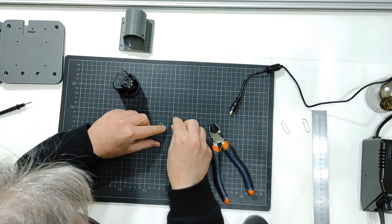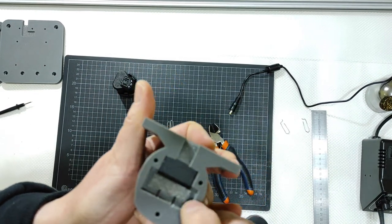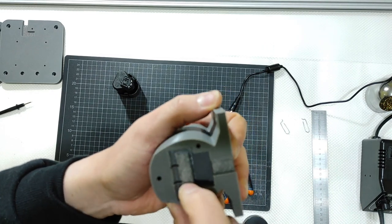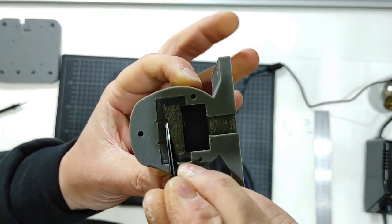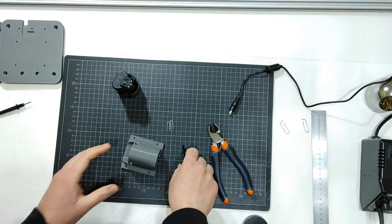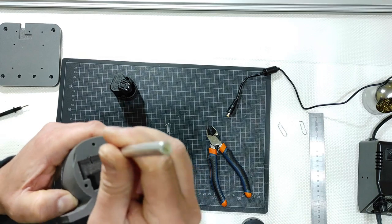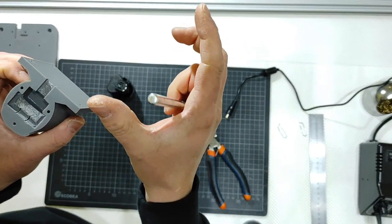Now let me have them removed. It is important that you see what I have here inside there, that you have those little cuts there that have been 3D printed there, those two long and narrow cuts in the plastic, in the PLA, one and two there, okay? And if they are too little, you just need to use one X-Acto knife and do this movement here, trying to go up and down, and try to make them a little longer and a little larger.